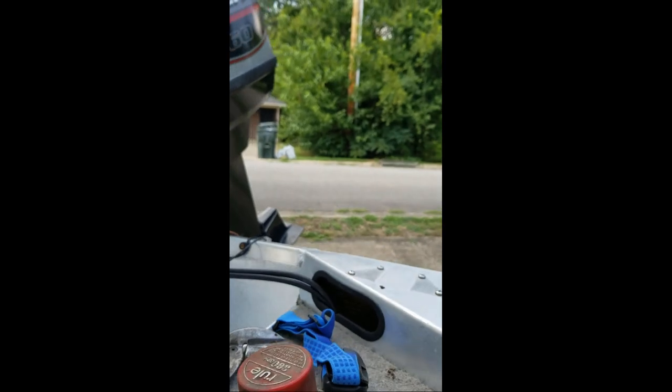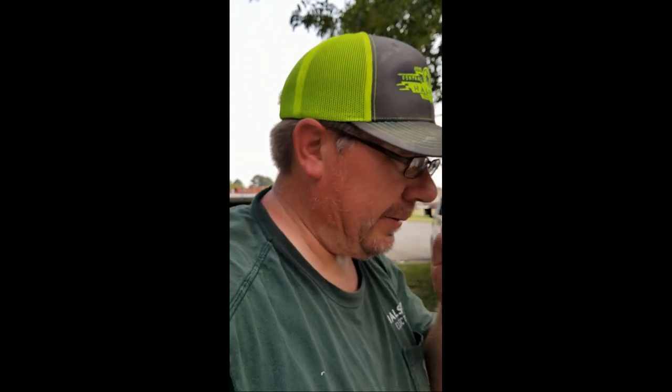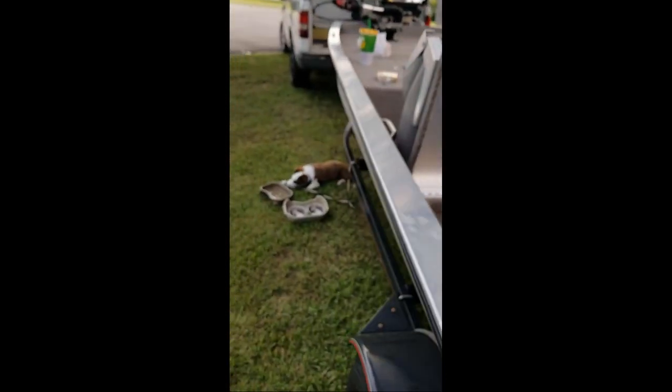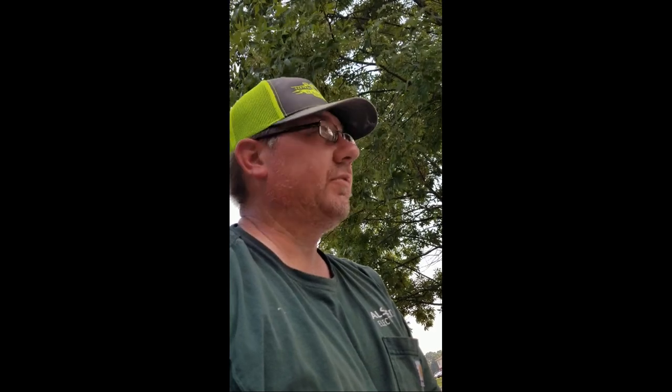My new pump will mount to that. So I've laid this out here — inch and three-eighths, that's how wide my C-channel beam is in the boat. Four and a half inches — that is how tall the C-channel is from the top of it to the bottom of the boat. This mark here I just kind of eyeballed — that's how much room I need to mount this bilge to. I'm going to go ahead and cut this right here, bend these into a Z-shape.